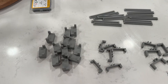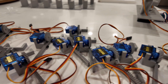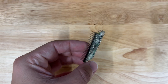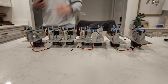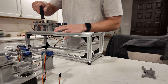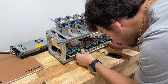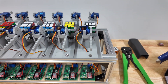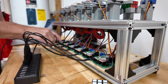Now that that's out of my system, let's actually build this thing. I built seven identical cube solvers. Each one has two servos for flipping the cube, a stepper motor underneath, and its own microcontroller. In total that's 14 servos, seven steppers, and a whole bunch of 3D printed parts. I mounted all seven solvers on top of an aluminum extrusion frame and stacked all the electronics underneath. Each solver is powered by its own Raspberry Pi Pico, which controls the motors independently.